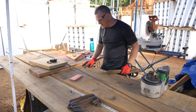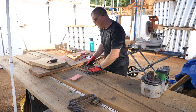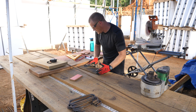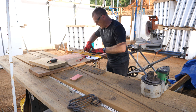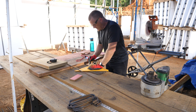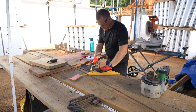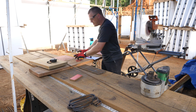I'm down here at the other end of the table. I've marked the exact lines on my table where I need to bend these. I'm going to smooth them all out and even them up — got a quick straight edge here. Since these are controlling the distance of the reinforcing rebar, spacing is kind of important, so I want to make sure I measure that and get it right.